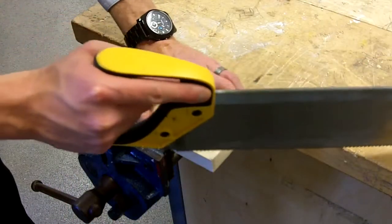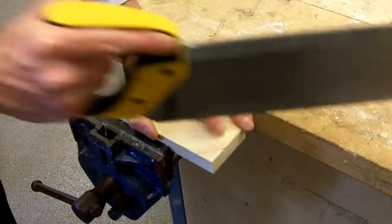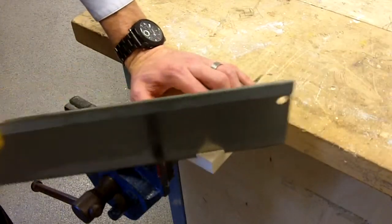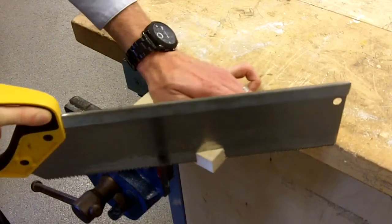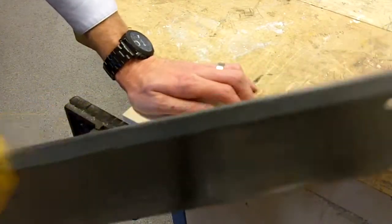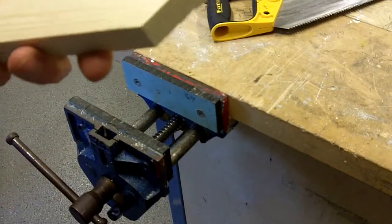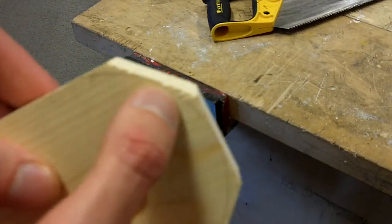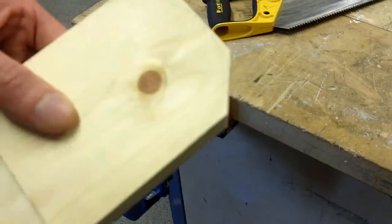Put my finger on, drag the saw back along that line — three times, twice, third time — and then just cut. You might find that your saw goes into the bench, so just tilt the back of your saw and just knock it off. Hopefully we will still again see that line as we can on the front there. It is dead important to slow up towards the end because what we don't really want is these chipping bits that come off the wood. We are now going to show you how to sand this curve to get it lovely and perfect.